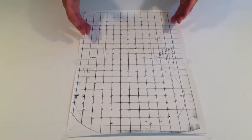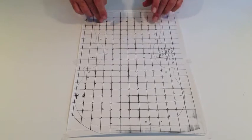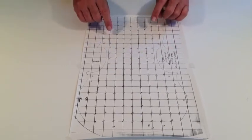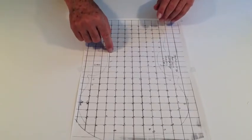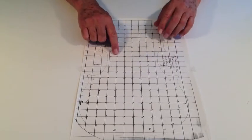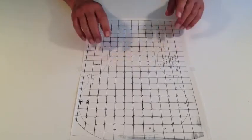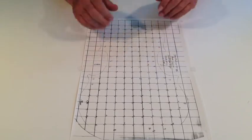From there, it's possible to make another map with the desired thicknesses. I use little triangular cutouts, place it over the plate as I'm making an instrument, make pencil marks and indicate the thicknesses, and work in thin until my plate equals this map of distribution.